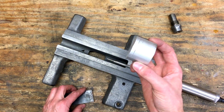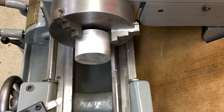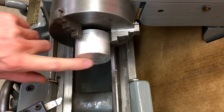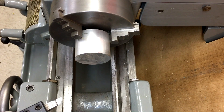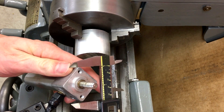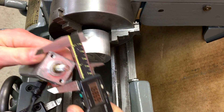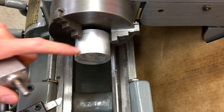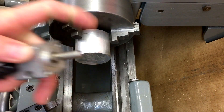We're going to turn a piece out of aluminum that's going to thread in here and have a flange on it so that we can put two screws back in this direction and mount our cylinder. We're also going to take a scrap of cold rolled quarter inch by about inch and a half, clean up the ends, put a piece of brass in, and drill that out with the size of the extension that's going to go through here — just as a guide and support for the lengthened rod. This is just a chunk of two inch diameter aluminum and the first thing I'm going to do is face off this side and then turn the diameter down to about 1 and 11/16 to match the cylinder.